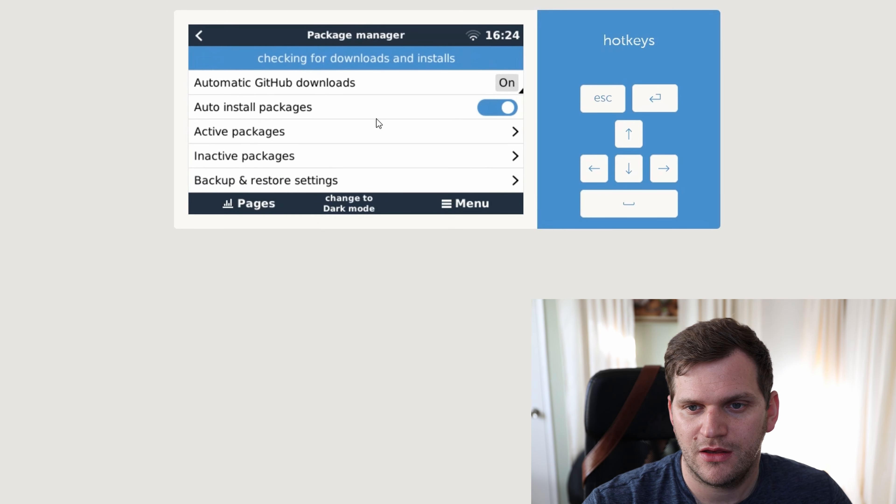So that means we will proceed with our Raspberry Pi 3, which is the production unit. Here we see more components, as I mentioned: propane tank, Raspberry Pi processor temperature, SmartShunt, and the smart solar charger MPPT. Going to settings, firmware — we can see the old version — and let's go to online updates. Update feed is official release, but it's the large image, so keep that in mind, it might take a little longer.